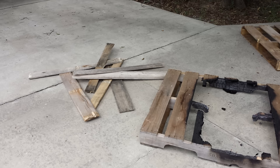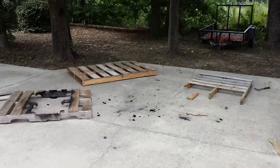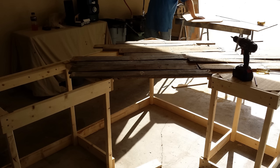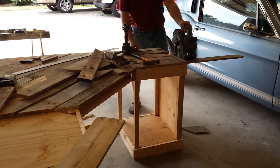Here's the pallet wood. I got pallets from a buddy — you'll see them all over the place at industrial yards. They're usually free because people are throwing them out anyway. I ripped apart the pallets using a crowbar and a hammer. Then I laid the pallet wood out on the desk and cut it with a jigsaw in a diagonal line to account for the L-shape. If you're doing a rectangular desk it's super easy — just lay them out, cut, and nail or screw them down.